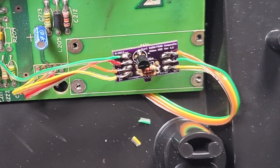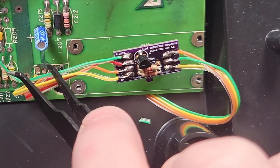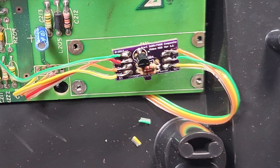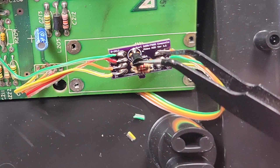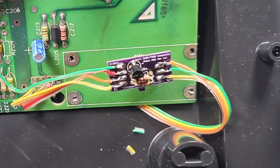Everything is soldered. To summarize: we've taken audio from R206, connected ground to pin one, power to pin three, and video to pin four, all soldered onto the circuit assembly. The output of that circuit assembly — audio, video, and ground — goes to the back of the case. At this point, if I plug this in I should get some epic Atari 2600 gameplay. I think I'm going to hook it up to the big TV.